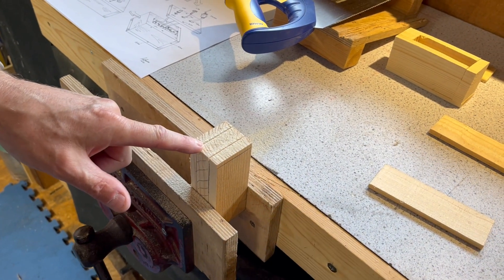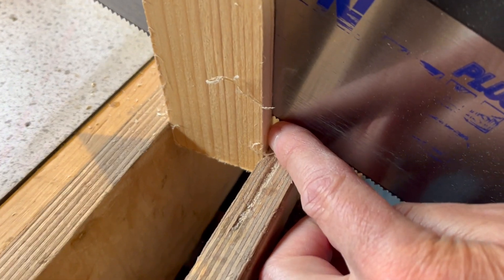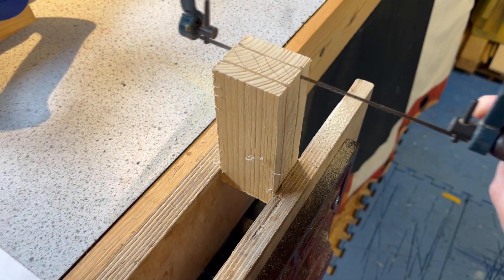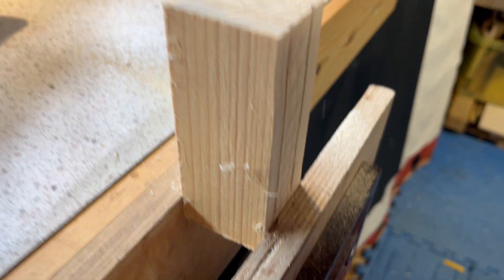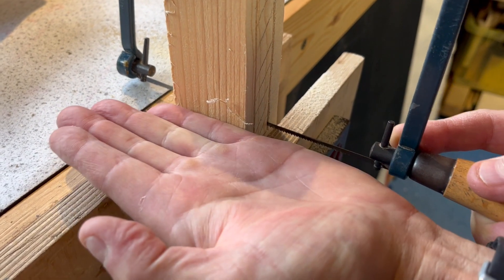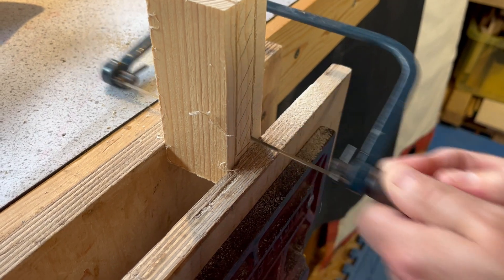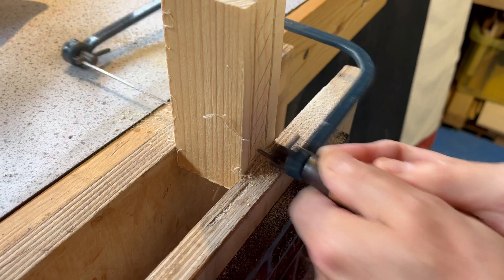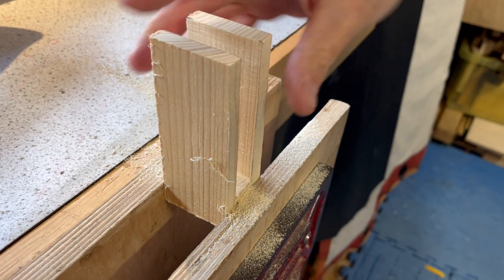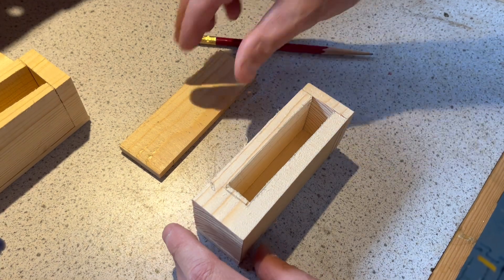I've gone down as far as I can on both of them. There's a little bit left — the further last part — where the saw won't allow you to go full depth. You could make it slightly shorter, but what I've done is go down further with the coping saw in that last piece and the same on the other. I'm going to turn the blade slightly before the end to cut this piece out. Make sure you keep it level, two hands on it, don't jam the blade or it'll break. There you go — that piece comes out. You're not going to see it, so it doesn't matter if it doesn't look perfect.